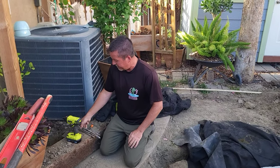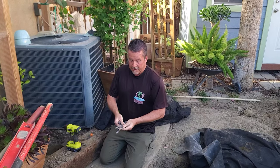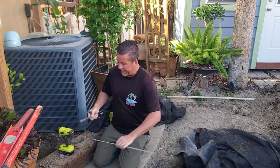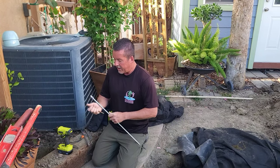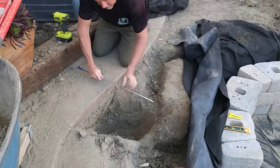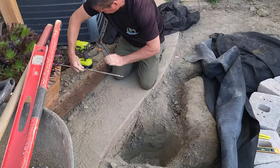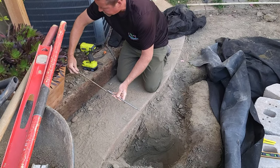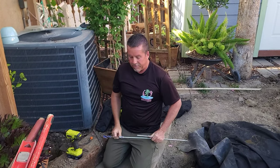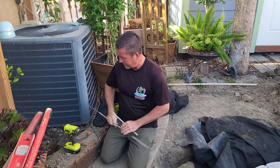But what I like to do is make things a little bit easier. You can pick these parts up — I got these from Lowe's — and these are little 12 to 14 inch extenders. Each one of these guys snaps on, and I've got an auger bit that goes down to the end. Basically what we do is start with one piece, push it through, then add another piece, continue to push it through, and when we're done we have a nice clean one-inch wide hole to fit that pipe through. No water, no mess, clean, professional, done. Save some money.